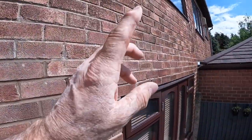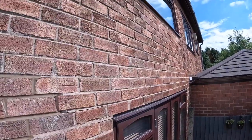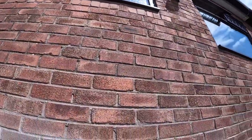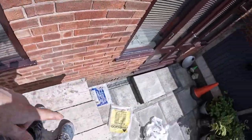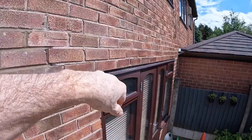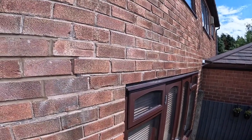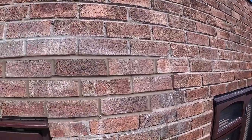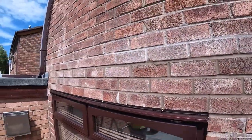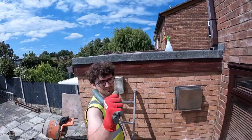There's actually seven. Next job is this one, which we're going to come back and do on Monday. So we're going to head off to Berry's first thing Monday and pick the lintel up for that. We might pick all the lintels up while we're there. We need another trestle, four extra planks for the extra width, because it's a 2.7 lintel. We need an extra acro, and we're going to bring strong boys in for that. So we're going to have three strong boys. So all done. A straightforward one.